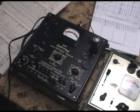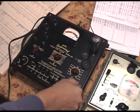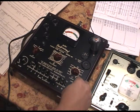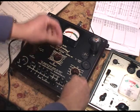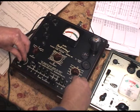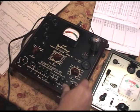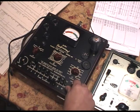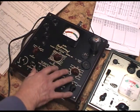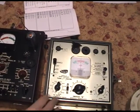With 2 up and 7 and 8 down, we turn on the value test. And there we go - it's in the green. Let me check the line because on tubes under load, bring down the line voltage setting a little bit. Let me crank it up - this should give a more accurate test. It's almost at the end of that gauge. So this tests good on this tester and on my Seco tube tester over here.